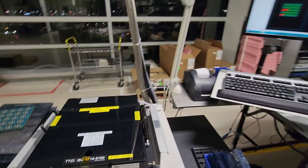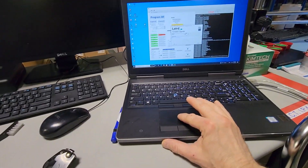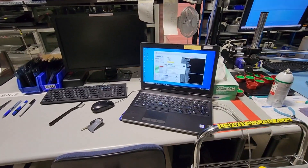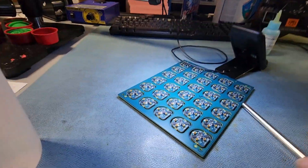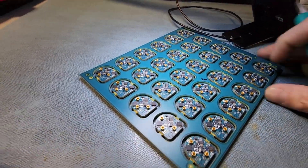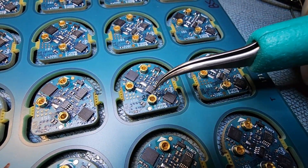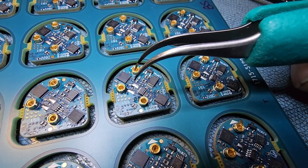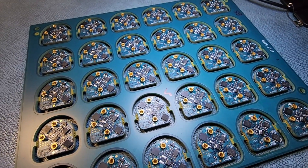KP-68 at work again. Doing a lot of stuff today — a little bit of ICT and circuit testing, and over here doing a bit of programming. Over here doing a lot of rework. It turns out last night we had a bad run. That component right there is placed 180 degrees out, so I have to go through each one and fix them all — one per board, 30 per panel, and this will be about the seventh panel I've done.